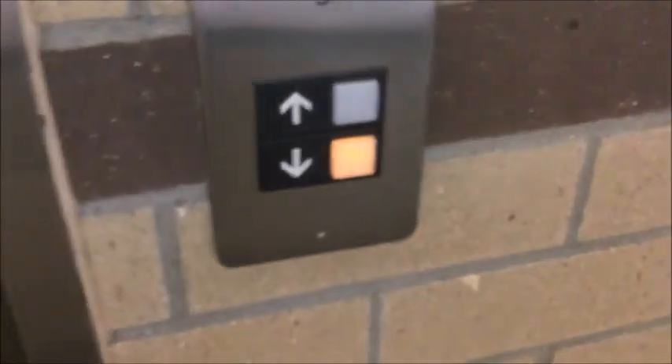Let's close it up and I'll press the call button for you guys while the doors open. Now we're going to call it. It's going to level. Oh, it went into nudge mode. Okay, now it's sitting. Now it's coming. What was that? It's going upstairs, right? No, it's coming down — it already went up there, I heard the motor. Hydraulic elevators: you'll hear a motor when it goes up and you'll hear a draining sound when it goes down. If you'll listen when we get in there. Oh, draining the hydraulic? Yes, the fluid.